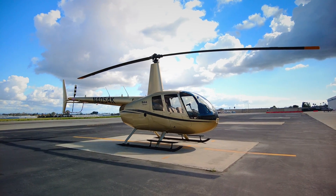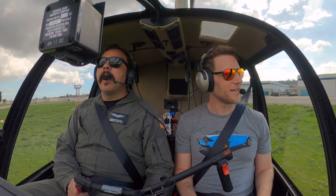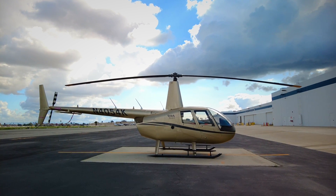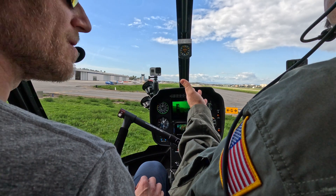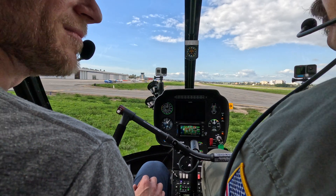Unlike the previous version where the empennage only protruded on the pilot side of the aircraft, it provides some dynamic stability improvements at or near the envelope of the aircraft. There's zero difference in handling qualities or characteristics of the aircraft. I was expecting some nuance like it's a little bit this or that — nothing. A lot of people have this perception when looking at the basic aerodynamics: now that horizontal stab is up farther, more under the rotor system, which would induce a pitching moment in a hover. But as you can see, it's hovering just like a normal helicopter with no different pitch angle.